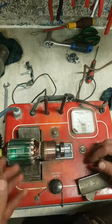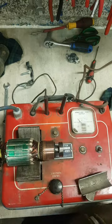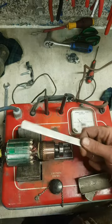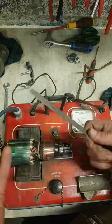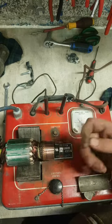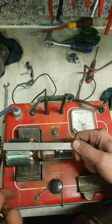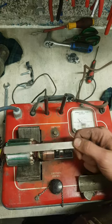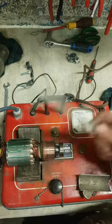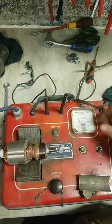So it actually makes a current inside the armature itself. So power is actually going through this here. Then whenever you put a third piece on top, this acts like basically a third winding. And that can actually interact with the AC magnetic current coming onto the armature. So she picks up the AC and gets attracted and unattracted to the bad segment. So this one here is bad as well, but this one here actually has a short.